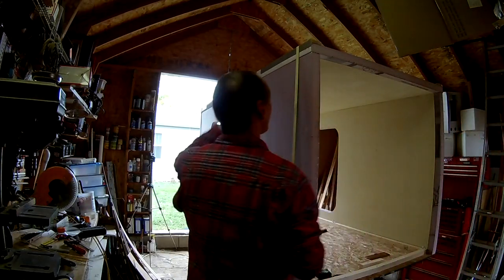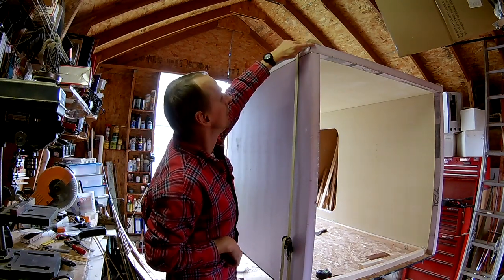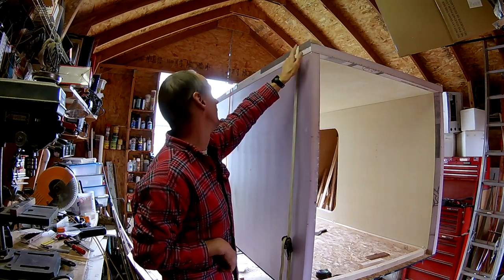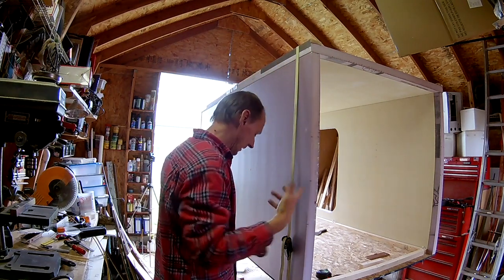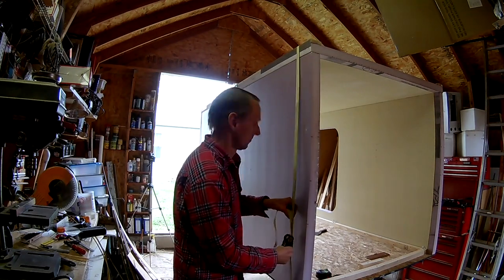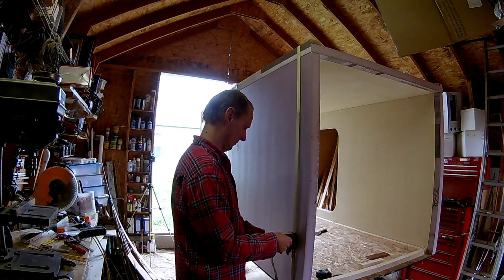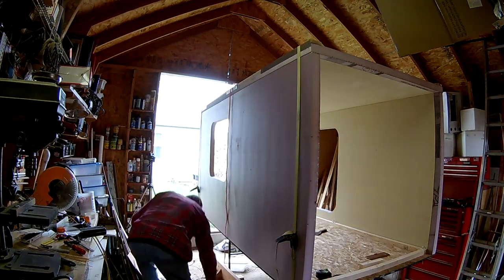Okay, so you do want to make sure that the flashing that you use comes down past the wood and onto the edge of the roof line so that it doesn't slide over when you tighten it back down. Okay, so we can go ahead and put a little bit more pressure on the roof. Make sure everything's holding in the right place.